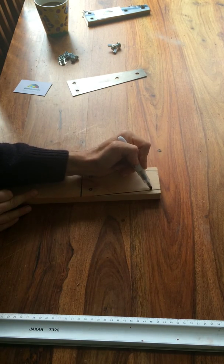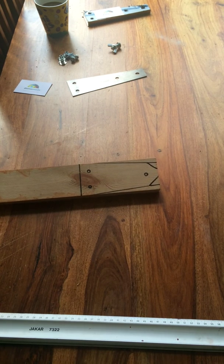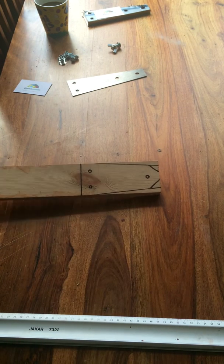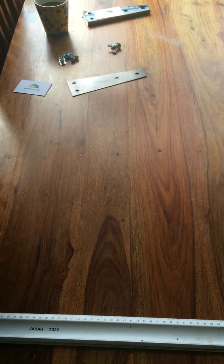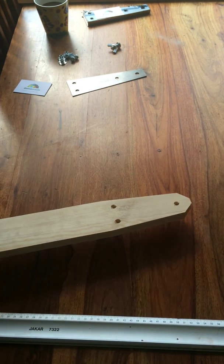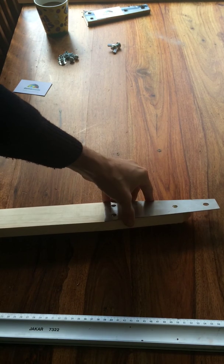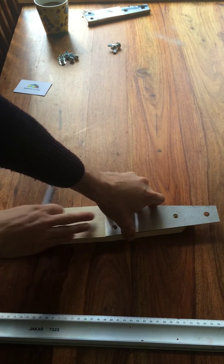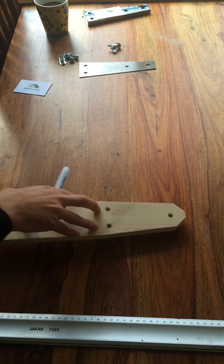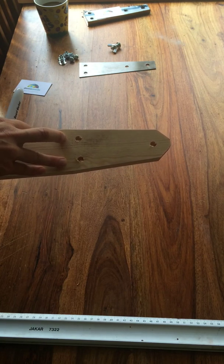You will also put in a rough 45 degree angle and trim it there as well. You can just trim that with a chop saw — it takes moments. The angle for these is about 60 degrees, and then 45 degrees there. Here is one we have already trimmed. You can see the bracket sits on nicely and the wood is flush with the bracket. You would then drill the holes with an 8mm drill bit if you have used the Dormade nuts and bolts pack. It doesn't take more than a couple of minutes to do each end.